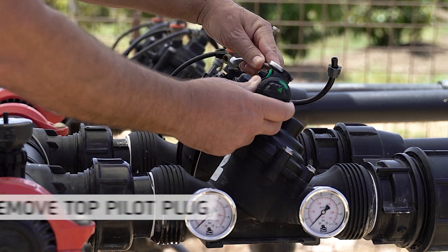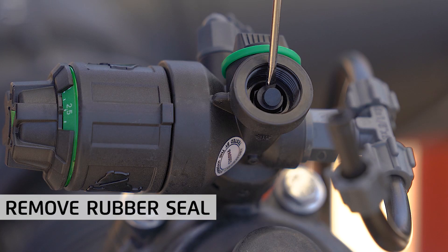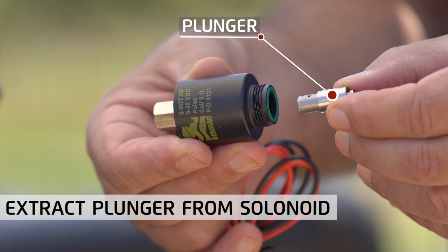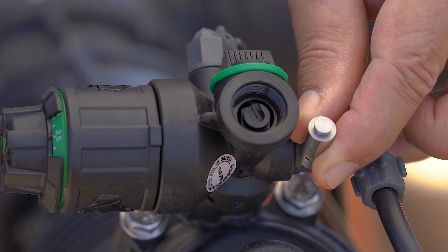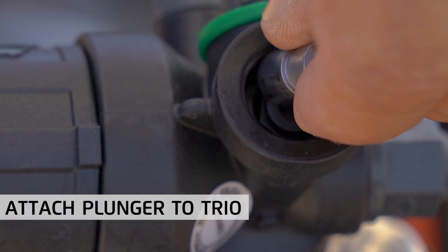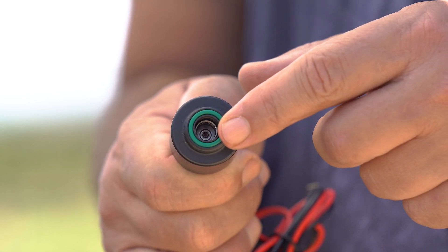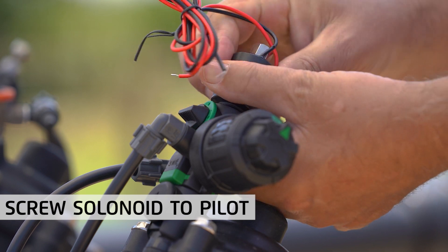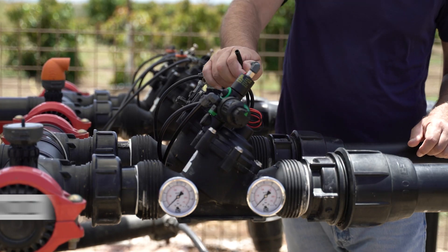Using a wrench, carefully unscrew the top pilot plug. Using a screwdriver, remove the small rubber seal inside the plunger clip. Proceed by extracting the plunger from the solenoid. The trio lock has a horseshoe shape which matches the shape of the edge of the solenoid's plunger. Attach the plunger to the trio by tilting it a bit and pushing its edge into the plunger clip until you hear a click. Before proceeding, verify that the green O-ring is attached to the solenoid. Now carefully screw the solenoid to the pilot to connect them. Complete the process by connecting the command tube to the solenoid.